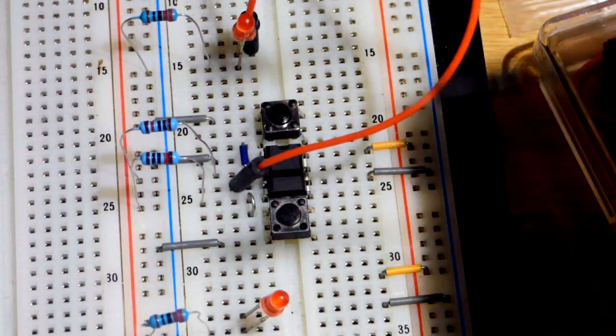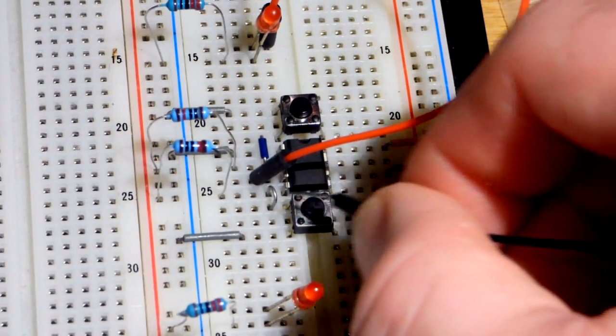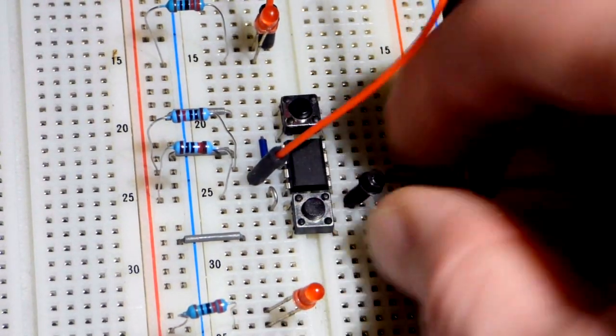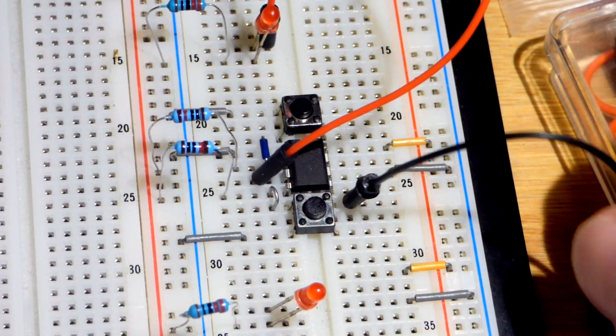It's less obnoxious, it's not as long, but we can either go to pin 4, or come to where the switch is, or even over here because it connects across there. So let's go over there. That's a little more out of the way, a little less black and stuff. So this is all connected right there. The switch is only separated top to bottom until you press it.